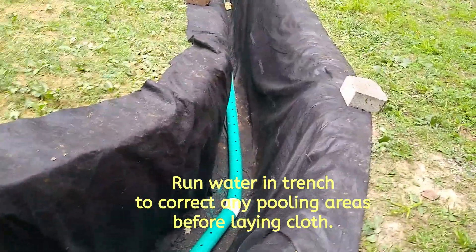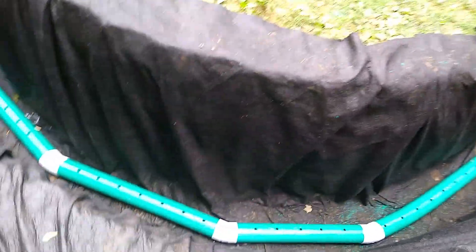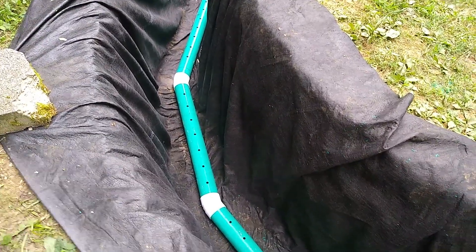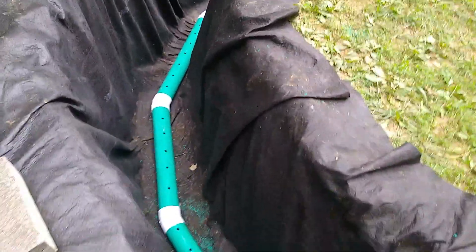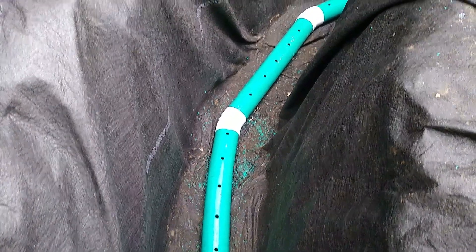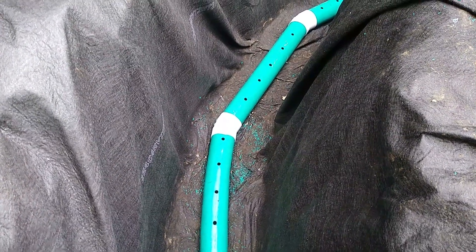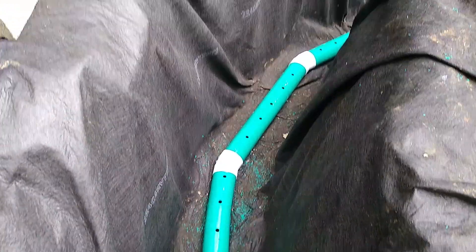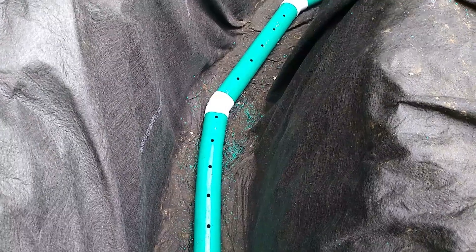I went four foot down here and then I had to use some 22-degree angles to make this work. When I originally was going to go with corrugated, I changed my mind and decided to go with SDR 35. I did run into a situation where the pipe ended up slipping out, so I had to cut it off and put another 22 in there. I used a heat gun and was able to bend this pipe — it really can be bent. You just got to be careful. If you heat it too much and it creates a dimple, just heat it up a little bit and it'll come right out.